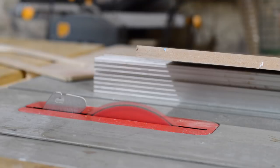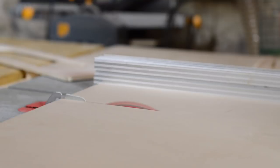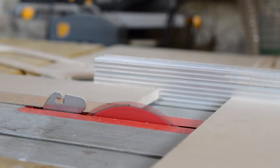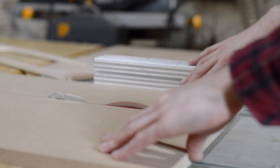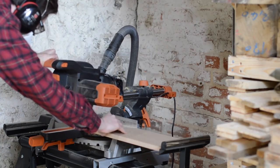I need two pieces to go on each end of the bench and also two ribs to go internally, all the same size. I can get all these pieces off the bits I chopped off the ends of the six foot lengths, but they're still going to be too long because I need to take into consideration the thicknesses of the two sides, so I need to take a little bit off them and I set up a stop block and do this on the mitre saw.